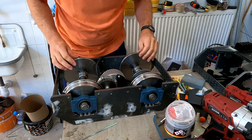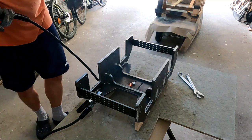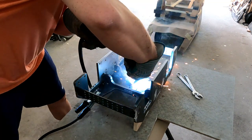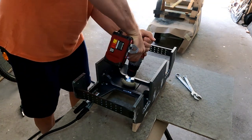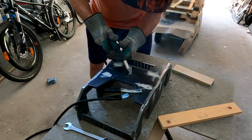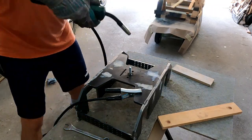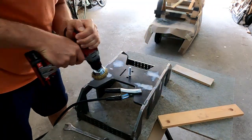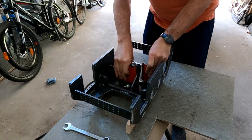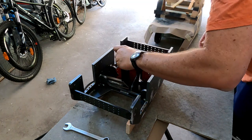I don't think it's likely that the two axles within one bogey would be that far off from each other — most of the time they would be fairly close to the same position. I think there is sufficient play in the chain for these scenarios, but I'll see once I try to run the loco. Next I started welding. First I needed the kingpin — I think it's an M33 bolt — just a regular galvanized screw. I put a fairly thick bead on the inside, then turned it and put a thinner bead on the top side to seal those surfaces so water can't get in.